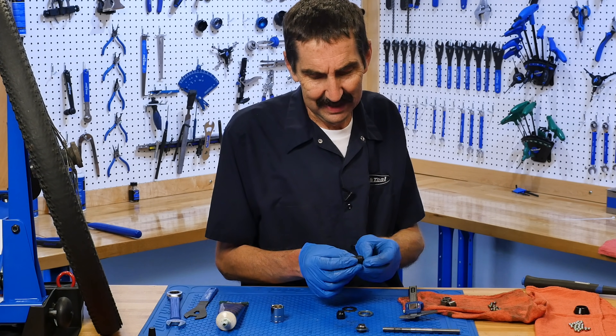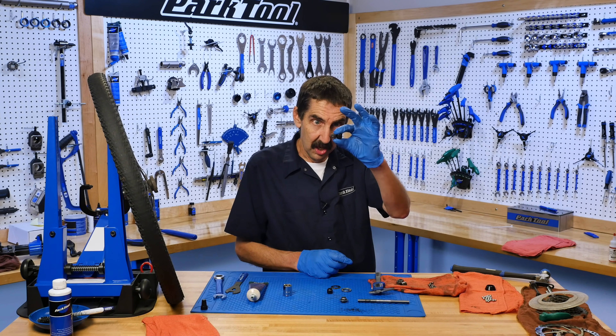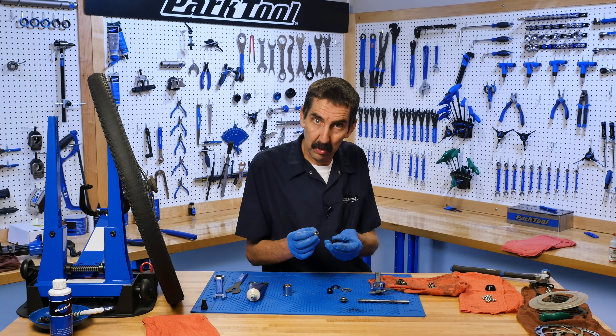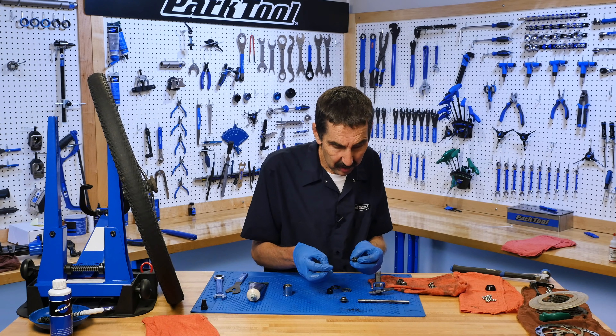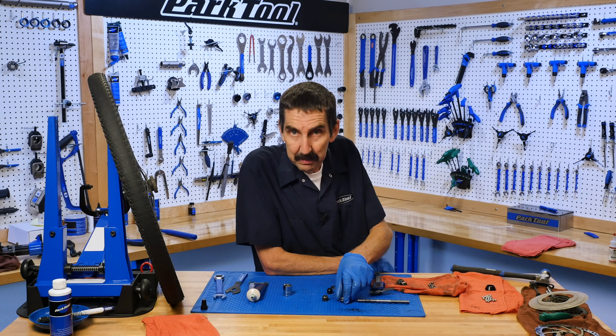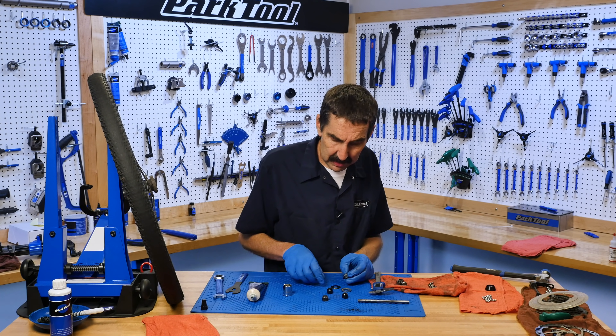There's a lot of different things to check. The diameter here is good, and they are as tall as one another. They both take a quarter inch ball bearing, and those radii match — that's all going to be wonderful. This is a little bit of an issue: that's a pressed seal, and we've got to transfer that over.